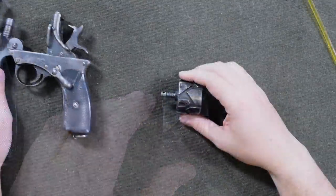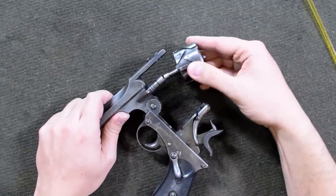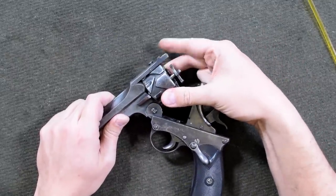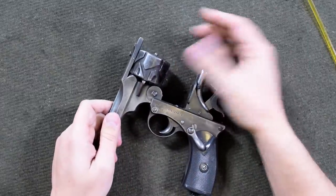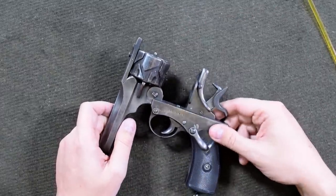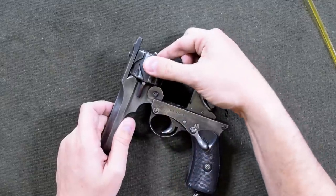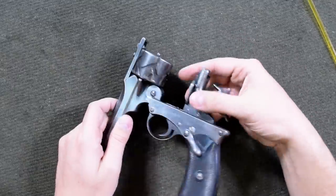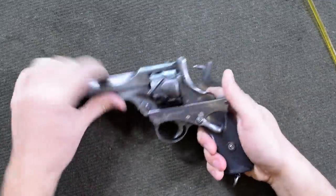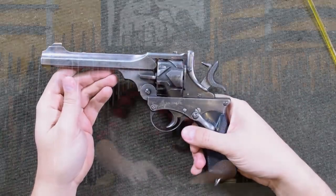Okay. All right, backing out. Again, I'm gonna show you how to reassemble this. You just feel for the groove and then push in and you're done. So that's super easy compared to reassembling the whole regular Webley. And again, the reason you have to have this non-rotating and in the correct orientation is because you want to have the matching groove come down on that spud when you close the action and she's ready to rock and roll. Since I don't really want to have to take this apart and reassemble it, let's get a look at the internals with a bit of computer magic.